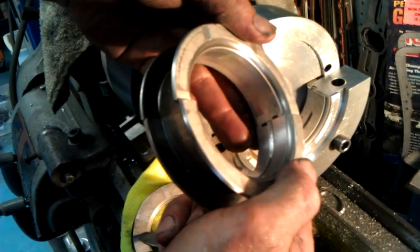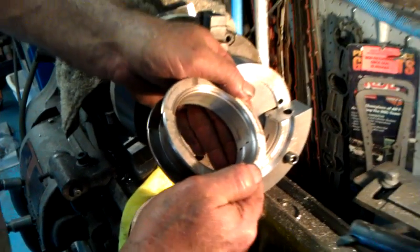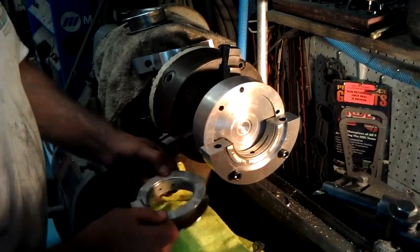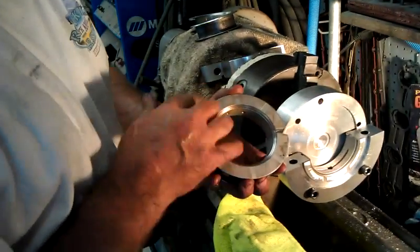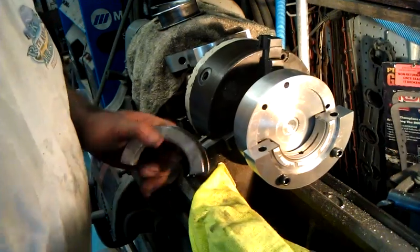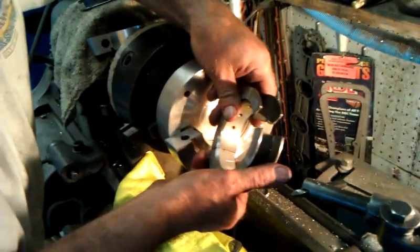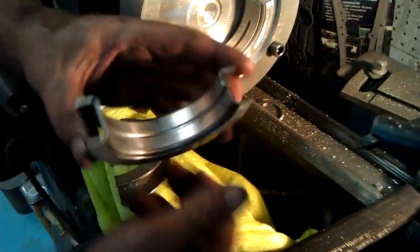You'll see here where this half groove goes ahead and stops — it goes right between the two tabs. That's the way it's going to be on a regular Dodge Viper block. So you have a choice of bearings to use — a huge single disc clutch or a double disc clutch. Instead of chewing up the thrust surfaces on this bearing or on the Viper crank, we need to get oil to these thrust surfaces. This truck bearing has a groove and a bevel already cut on it, and this is the same oil groove that you have when you take a regular Dodge Viper bearing and cut the bevel in it.